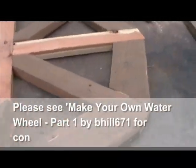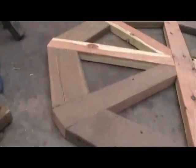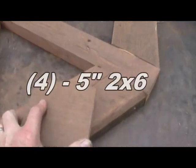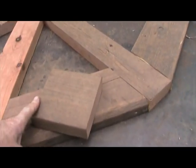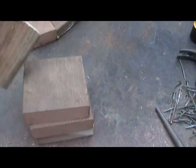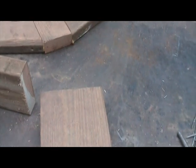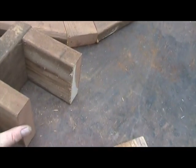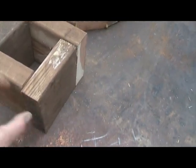What we're going to do is the center hub, which is back to our old 2x6 deck boards. We're going to cut four pieces five inches long, and you're only going to make one of these, so you only need four pieces. Four five-inch 2x6 pieces cut to make your hub — you're going to arrange them in a corner-by-corner fashion so that you end up with a nice little square like so.